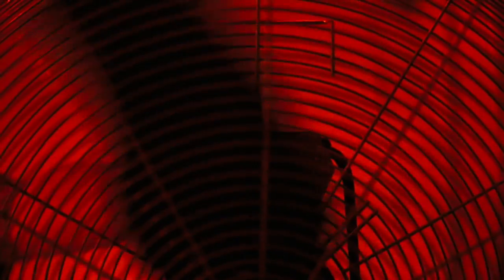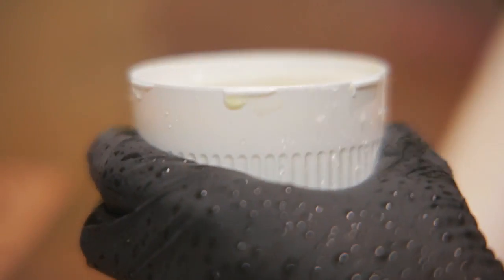Sensitized in potassium dichromate. Then it's dried flat against the surface for a certain amount of time at a certain humidity and a certain temperature. It is then peeled off of that surface and placed in a box where it has to set and reach equilibrium for about a half hour.